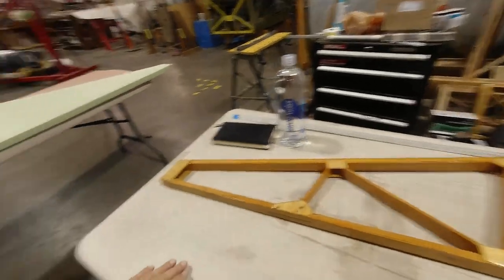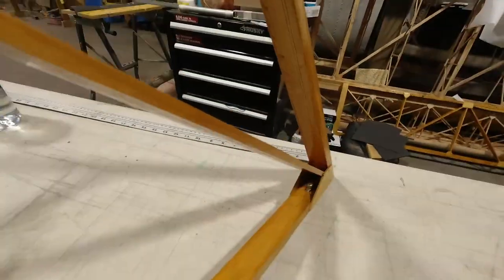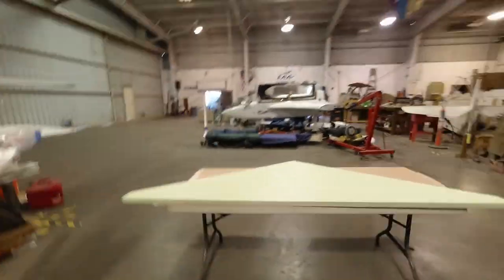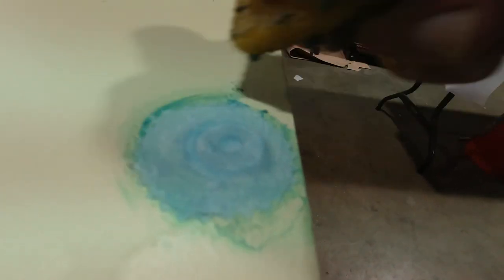Meanwhile, I'm going to work on covering the vertical stab, which I have my camera mount in place. I double checked everything's good under here with my nut plates, so that's important. So I'll just sand the places where the fabric's gonna adhere to that and then get that in place. And first we're gonna do that. Okay. All right, so I got these all taken care of. Now I'm just gonna take my eraser and pick up some excess glue here.